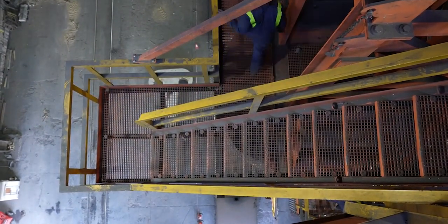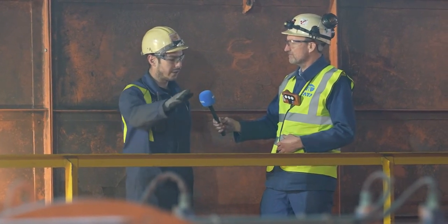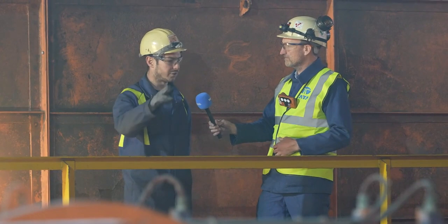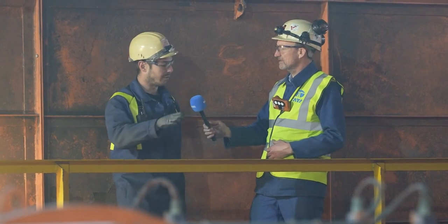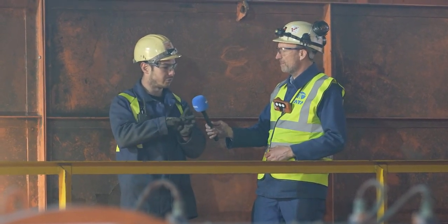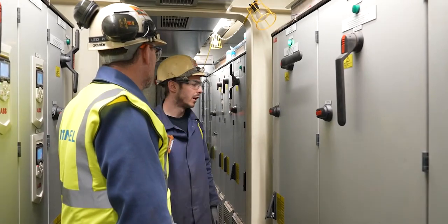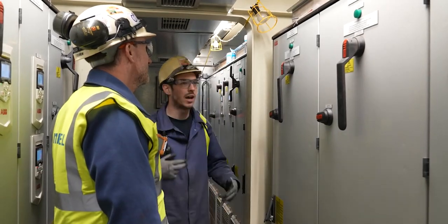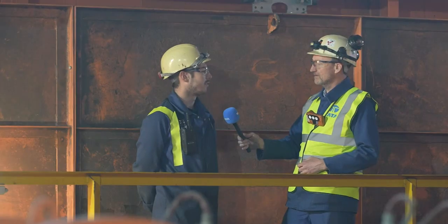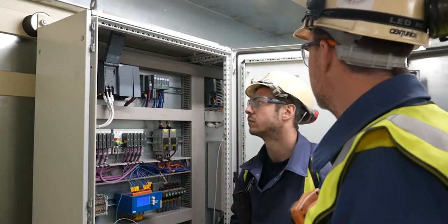On the bay there's the high voltage 3.3kV — we call them down-shop rails — so the three lines supply voltage to the crane via the carbon shoes. The carbon shoes on the crane travel up and down the bay, apply pressure to the rails, and the power is transmitted through those up to the transformer house. We transform the high voltage electricity down to low voltage, which is distributed around the crane for the variable frequency drives, auxiliary power supplies, and the things that make the crane work.